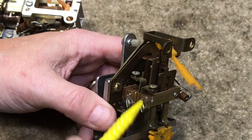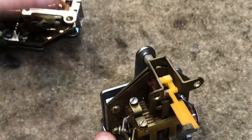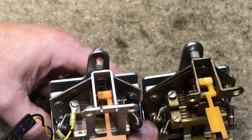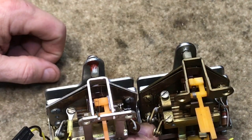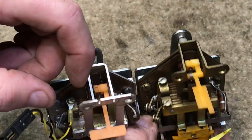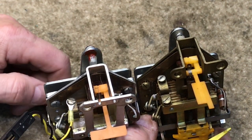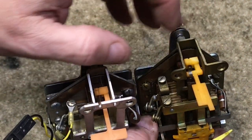That's the big difference electrically. The flap on this particular relay and the single 1A relay are different sizes and different functions. You can mechanically put the 1A in a hopper for this other relay; however, it will not function correctly because the hopper is narrower for the 230 series than it is for the 1C/1D series. I will show the hopper in a moment. These two relays are very close in appearance, and I'll show the functions of one — it's the same on both relays with the exception of the dial shorting contacts.